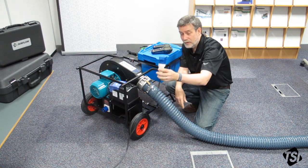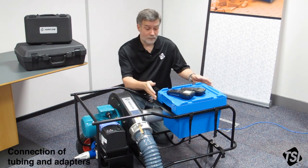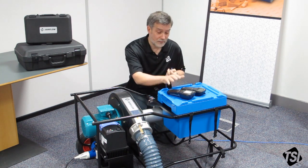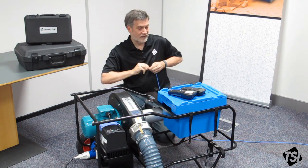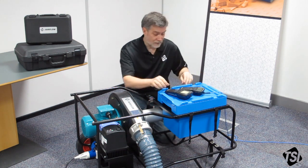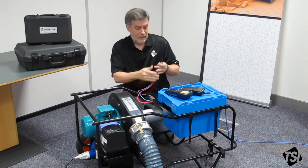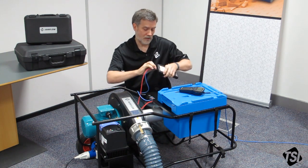Don't forget to connect the plug to the socket on the end of the Panda for your power supply. I've already unpacked the instruments and the tubing from the instrument box. The static pressure tubing is already connected to the ductwork under test, and we're going to connect that to the PDM610. Before you connect any of the instruments, make sure that they've been zeroed first — both instruments are already zeroed. To make the connection easier, we apply these tube adapters to each of the tubes so you can push the tube on quite easily. This tube goes to the positive connection on the PDM610 to measure your static readings. For the TA465P, we're going to measure the readings from the flow grid. It's important you get these tubes the right way round: red for positive, blue for negative, as clearly labelled on the side. So put the red onto the positive and blue onto the negative — the same applies when connecting back to the TA465P: red to the positive connector and blue to the negative connector.